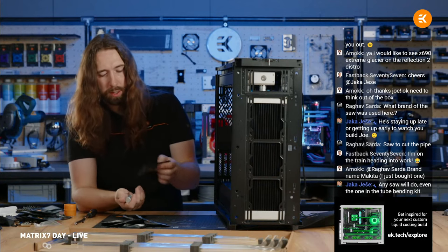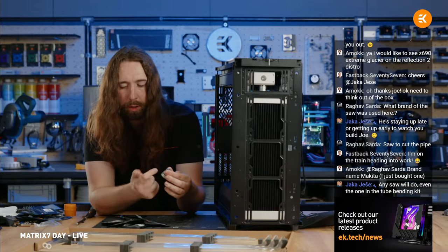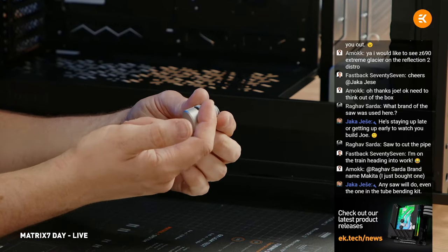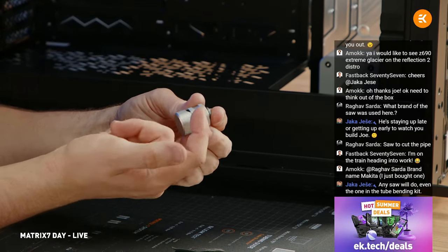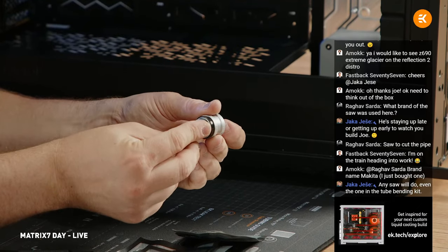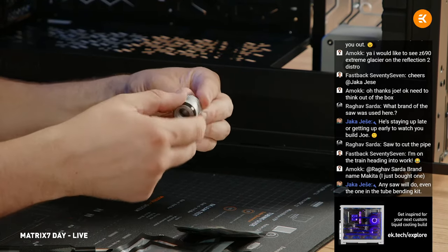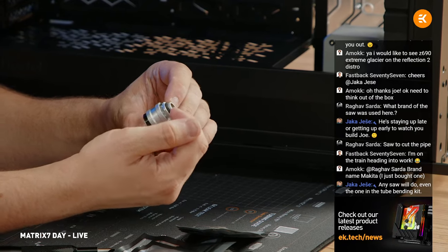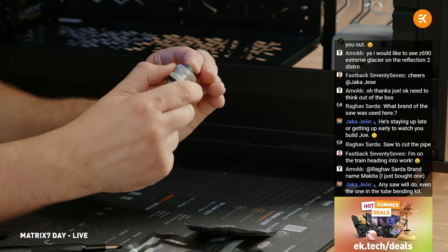So the other port which needs to go here is the drain port. I think you've probably all seen how the drain ports work now, but they basically have this final plug, so you know that it's definitely closed, and this actually holds the valve closed so it doesn't fill up with coolant in the middle and fall out when you take the plug off. So this ensures that the valve is closed whenever it's installed. Then when it comes to open it, you remove the plug and this collar slides back and that opens it up. And when it comes to tightening it, you've opened the collar and you spin this, it's not actually connected to the base, so you don't accidentally unthread the fitting from the distro plate. But when you want to tighten it, it rides onto this hexagon, and then it all locks together.